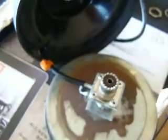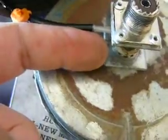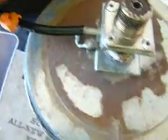Use a good soldering job on that too. Put a strain relief in — I measured Wilson's and it was about two inches, so I put the strain relief in at about two inches. You're going to push the coax up in there a little bit when you assemble it.